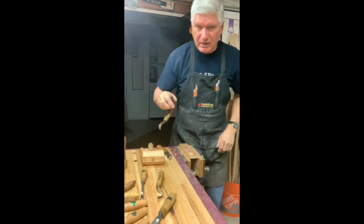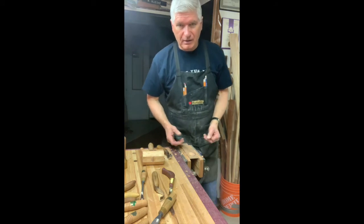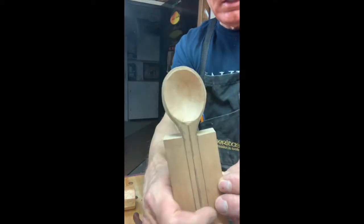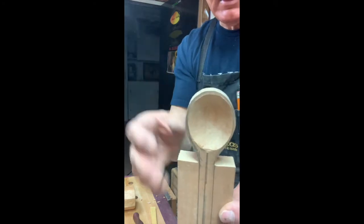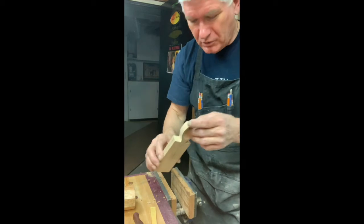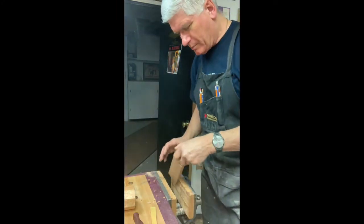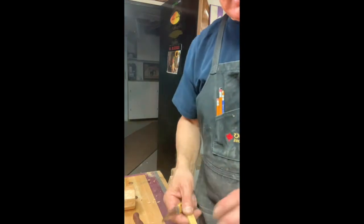The bowl is almost done. I'll finish it off when we come back, then start on the outside of the spoon. I've taken the outside shape and cut it out with a bandsaw — my students all know how to use a bandsaw safely. You could also use a coping saw. Now I'm putting it back in the bench vise. Note that I left the shaft portion intact — that gives me more clamping surface.